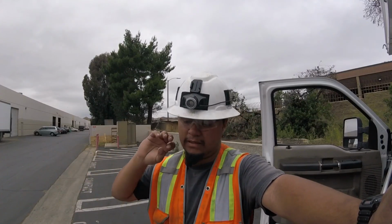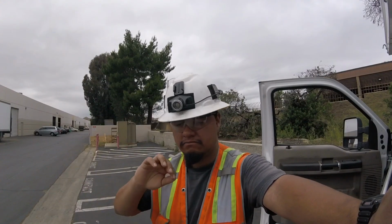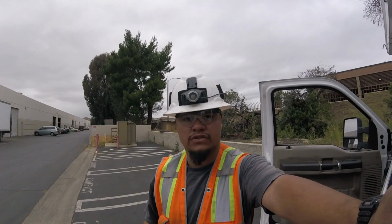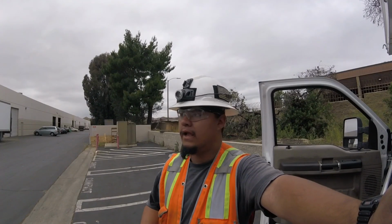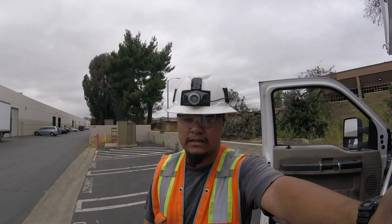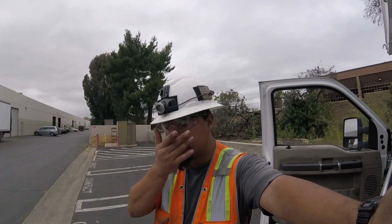The only thing we will be doing is coming back to put a cap where that sensor goes that you guys saw. We're just going to cap that in, put some Teflon tape and pipe dope, make sure it's really sealed tight, so in the future no oil leaks out of it again, and just leave it as is. It's really, really ridiculous to replace the sensor this many times, 4 times on one machine.